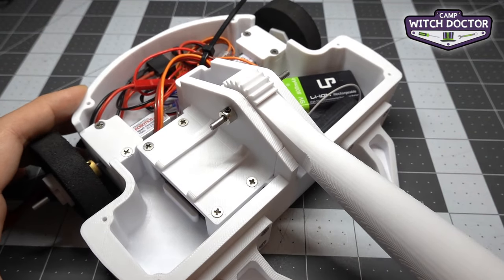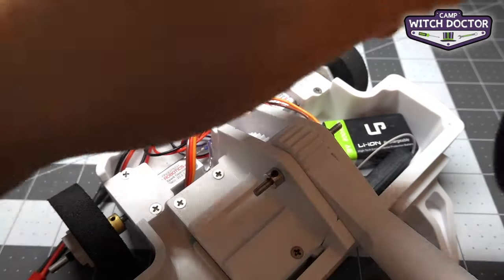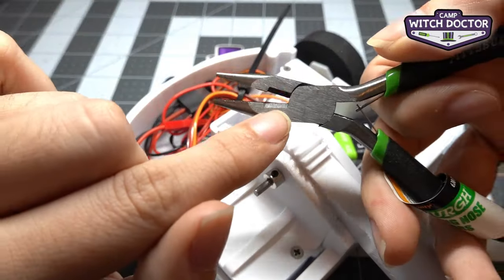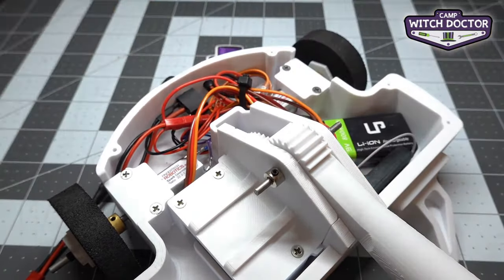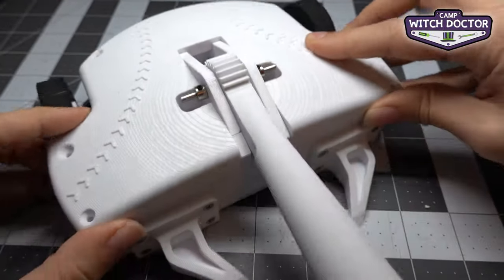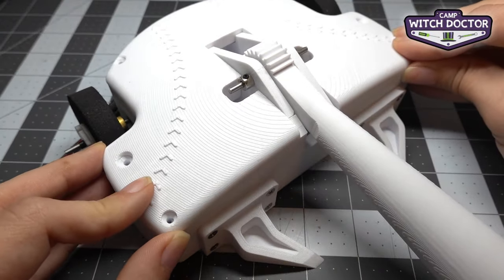The last step to finish this robot is to put the top plate on. In the last video we used a zip tie to make sure all our wiring was constrained and wouldn't be pinched when we put the top plate on. I'm going to go ahead and cut the zip tie a little bit shorter since it's in the way. You'll notice your pliers have a little cutting side — use that to cut the zip tie. Now that it's cut, let's put our top plate on. It has these cutouts which should make it easy to slide over the top. Make sure nothing's pinched, no pinched wires, then install all the top plate screws and your robot will be put together.